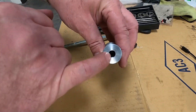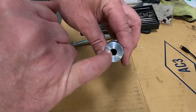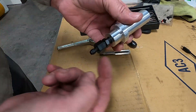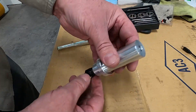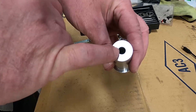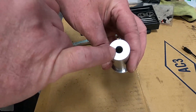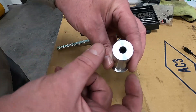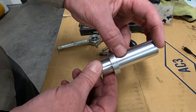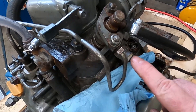You can see how big that opening is. The pressure from the cylinder is going to enter here and go up to the gauge at the top. I am actually concerned that this opening is so big that it's going to affect the reading — it's going to lower the compression reading because there's that much more volume available for the air to expand.